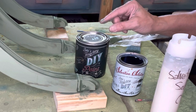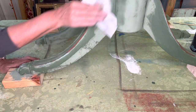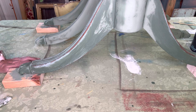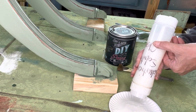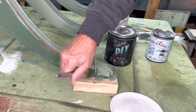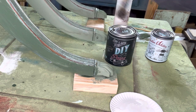So now I'm going to distress this and then put the Salvation Solution on to stop the bleed-through. You can distress as much off as you want. All you want to do is get down to that wood layer so that when you distress it, the Salvation Solution is laying right on top of that. If I had known before that it was going to have bleed-through, I would have put the Salvation Solution on first and then a coat of paint. With a smaller brush, I'm going to apply it just to this leg — it's the only place that it's bleeding, so I don't have to apply it to the whole table.